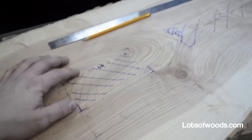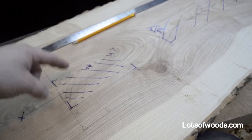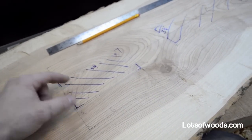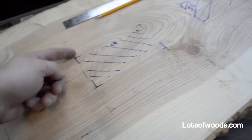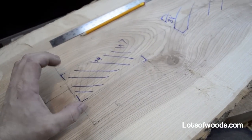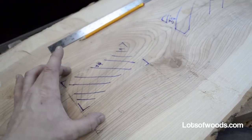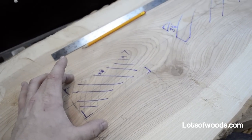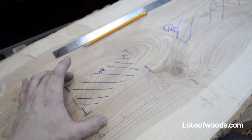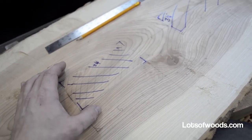They're going to be the poppets. And so this is going to be a mortise, and it's going to receive a through wedge tenon. I've got 7 inches across and 6 long, and so the mortise is going to be 3 1/4, and that way you have some shoulders to sit on. It's just going to provide plenty of support when the wedge is hammered through the tenon underneath.